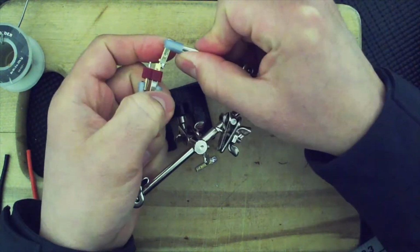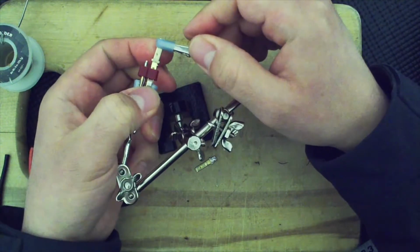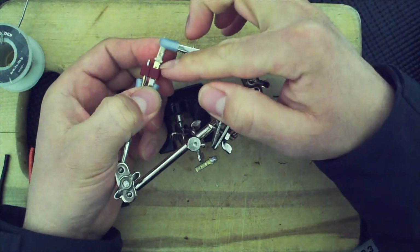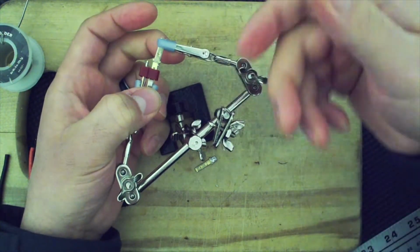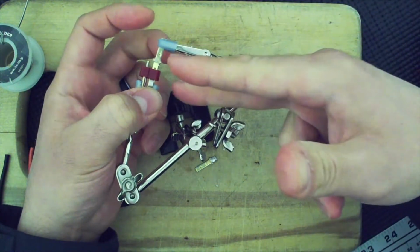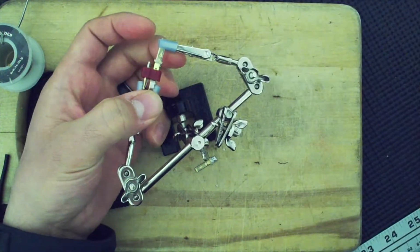That's what you want to be touching. You don't want to touch the metal. So the insulation on these alligator clips. And I'm going to apply the heat right here. There's solder on both of them, so it should work. After you apply the heat, you could grab some pliers as it's hot and then squeeze them together. That will work as well.